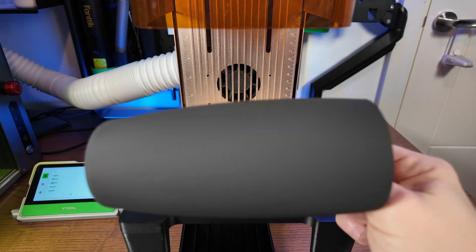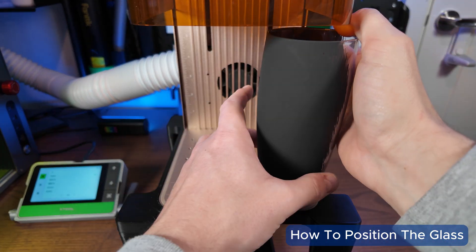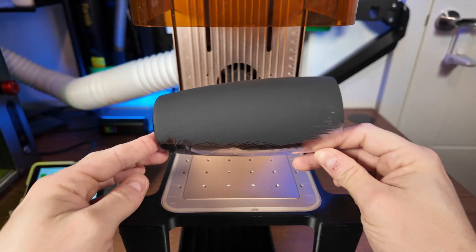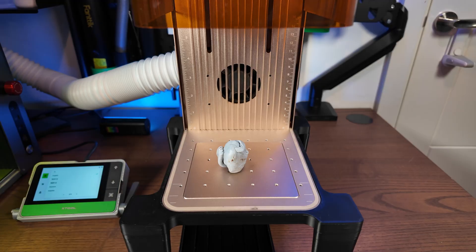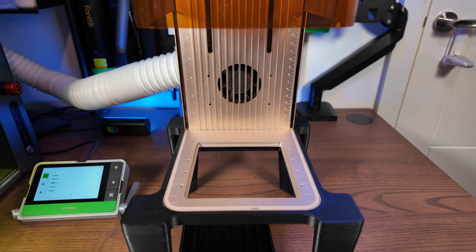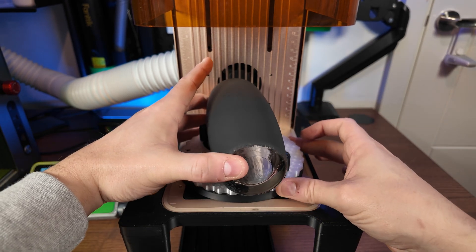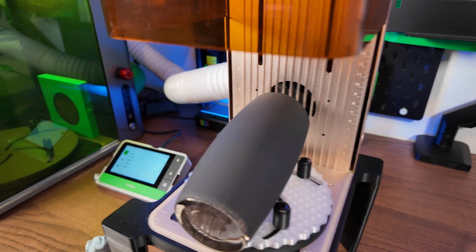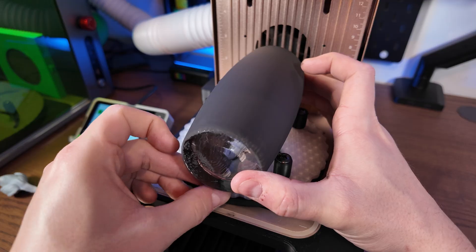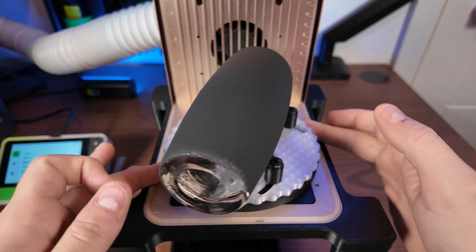Our paint has dried and it's relatively smooth, though I do have a couple of thick patches which may prove troublesome. Now we need to mount it onto the laser bed. My glass has a tapered edge, so to handle that I'm using a self-centering jig combined with a bit of blue tack for it to sit into. Between those two things we have it positioned and straight.